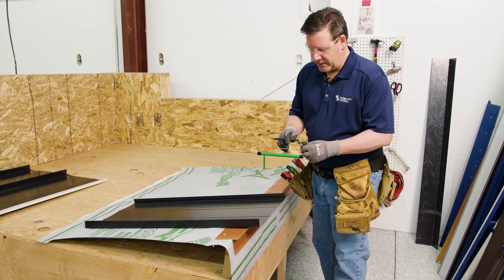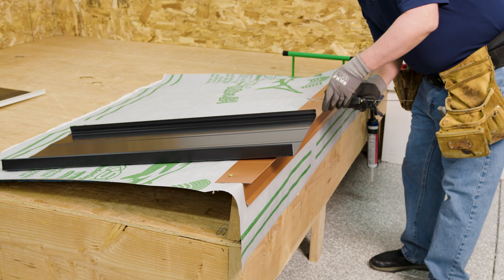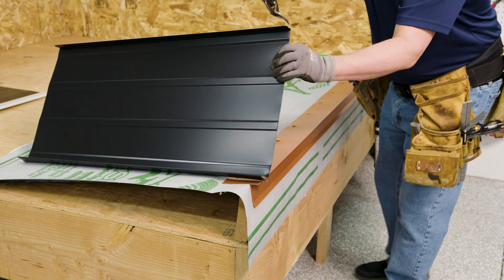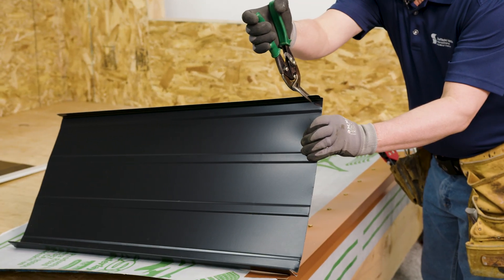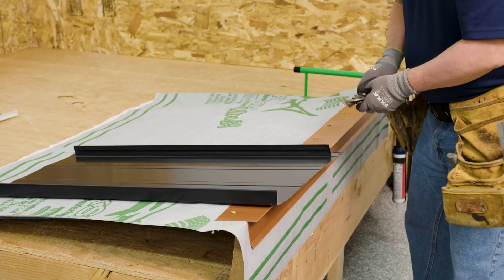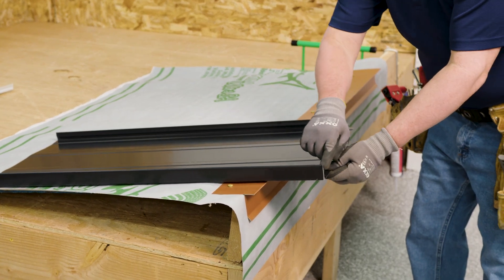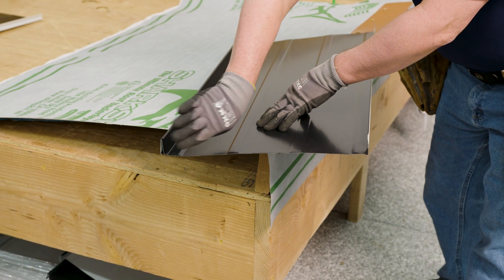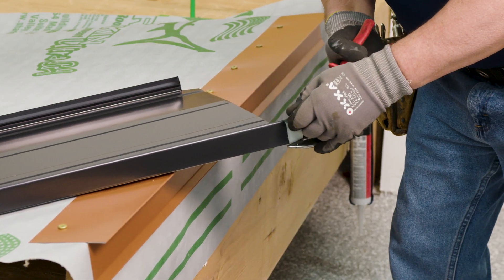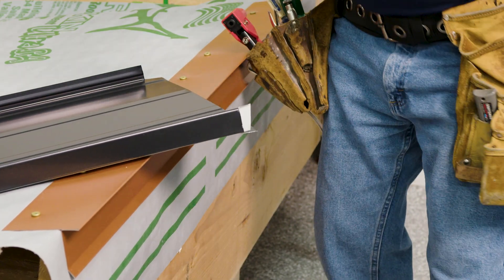I'm going to mark one inch on both sides. I cut down — you can cut this at a small angle right to there. Get that flat, flattened out, and finish it off. Then I'm going to cut up this side, but we're going to leave the inside of the rib for the in-cap. We'll tighten that up after we hem that over.